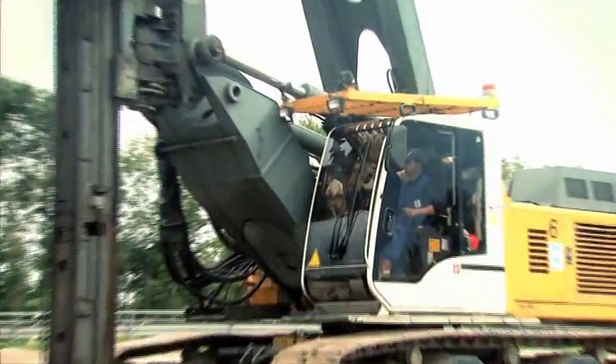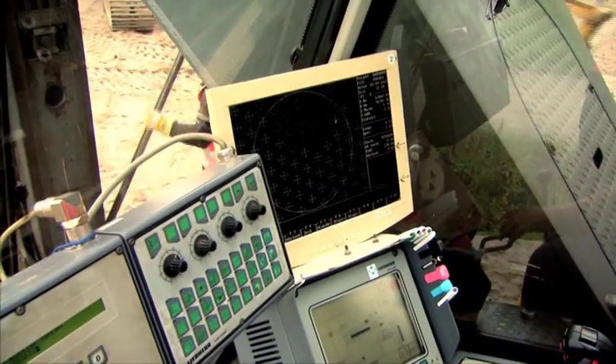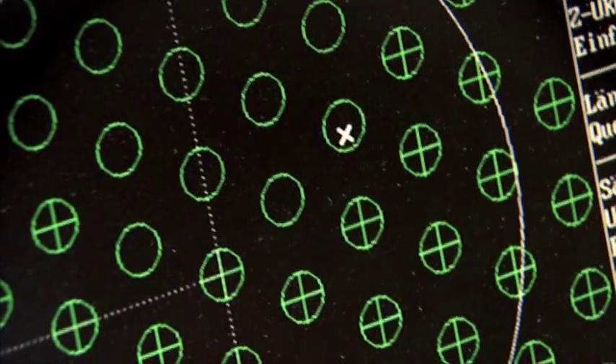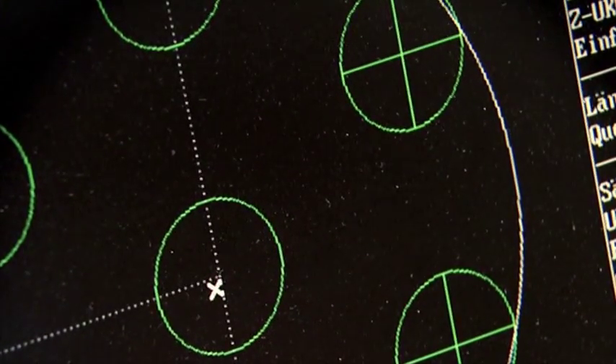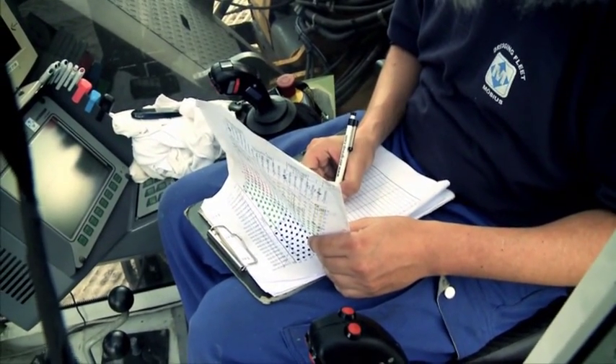The production of the GEC takes place with a piling machine on which a leader mounted vibrator device is operated. On his display the rig operator sees the column plan and with the use of GPS identifies the correct position for the displacement pipe. For each column, all installation related machine readings are automatically recorded and can be printed out in the form of an installation summary for each column location.